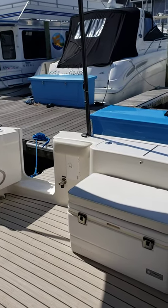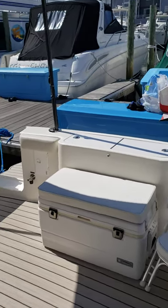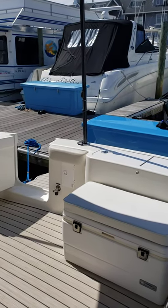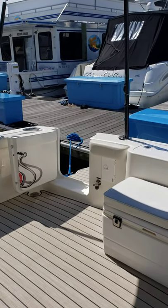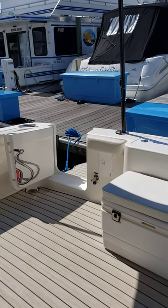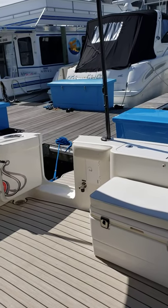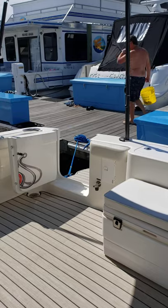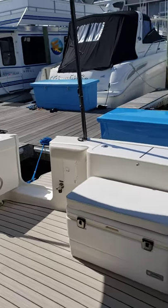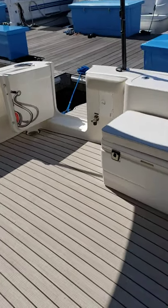Then they went to the D9 engines — you'll see a lot of these boats advertised with a D9, which is just over 500 horses, which was okay. But then they decided to take the D12 engines out of the 50-footer, which give you 715 horses each. So this boat has 1,430 horses total. Wide open throttle she'll do 31-32 knots, cruise at 24 knots. Burn rate is good, she gets up on plane easily, and there's plenty of room to get around the engine. They finally got it right on this boat, and you can benefit from that.